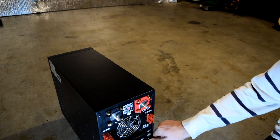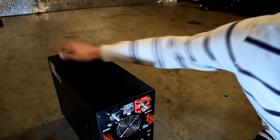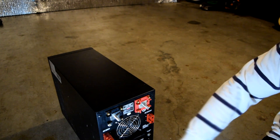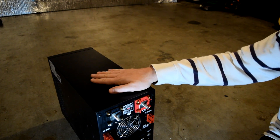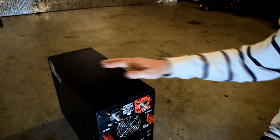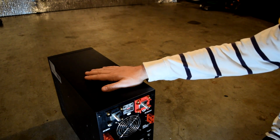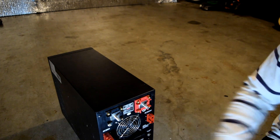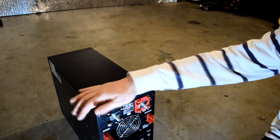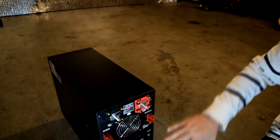There's an SW switch for turning on and off the generator remotely, and a connection for a remote display. If you wanted to hide the equipment and batteries in a closet, you'd want a vented closet if using lead-acid batteries. If you're not using a vented situation, you want to use AGM batteries, which are preferred for non-vented solar panel systems.